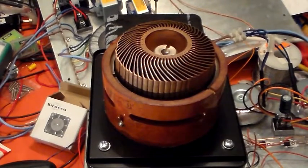If I do want to regulate that fan voltage, or maybe even just stick a resistor in there to drop it down by a volt so that it's about 14.5 volts — the spec is 13.8, so they'd run at 14 and a bit, maybe 14.8, without too much bother. They'll probably run at 15.6 without too much hassle, but I'll maybe put a resistor in there just to drop that down a little bit and maybe drop the airflow down to about 90 cubic feet a minute. It might make the fans a little quieter.